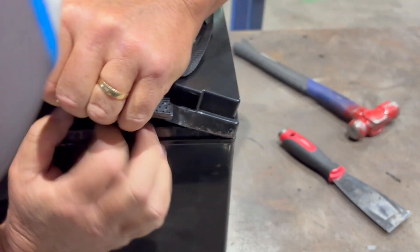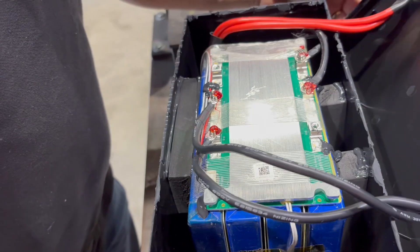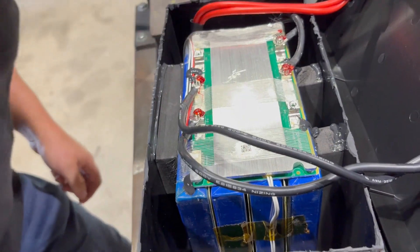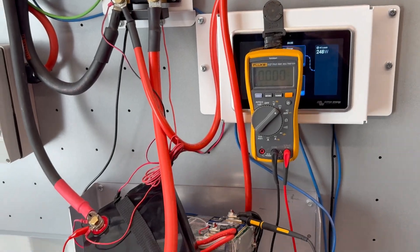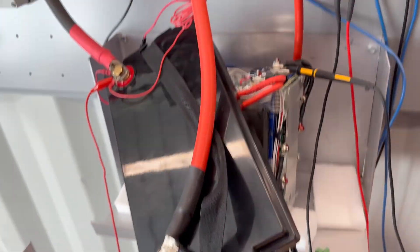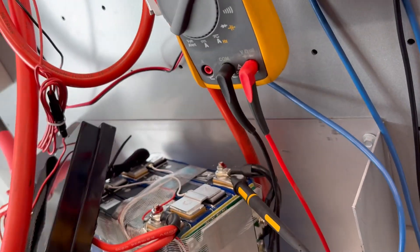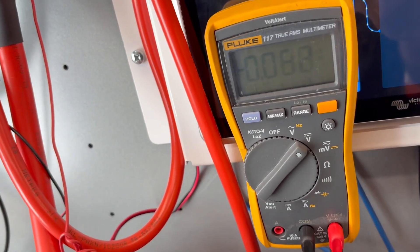Internally it's exactly what you'd expect — high-density foam, silicone — and overall it looks like not a terrible build. But now that we've got access we can check the cell voltages and find out what's really going on. I've got the whole thing apart now. I've rebooted the BMS via the power supply, which is now off, and I've got the cell pack out — it's pretty rough but it's there.